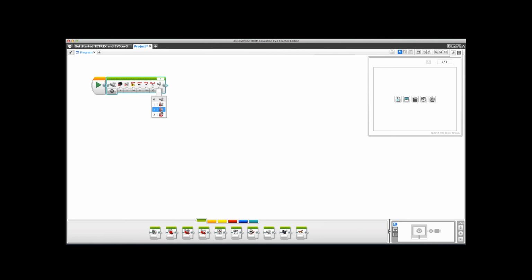It's called set timeout. And basically what this one does is, in the HiTechnic control boxes, there's by default a safety measure that if the block doesn't hear from a controller or programmer, the programmable brain, about every 3 seconds, about 2.5 to 3 seconds, it thinks there's a problem. So to keep from having runaway robots or a safety issue, there by default is a timeout invoked. And if you don't want to use that timeout, then you have to actually disable it with this operation under, excuse me, set timeout.